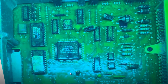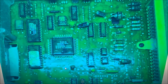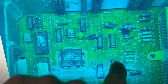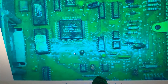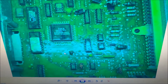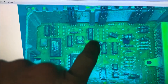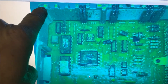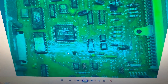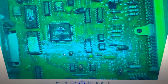The experiment I wanted to try was taking a picture of the board while it was under a UV light. Because oftentimes, like around the capacitors, you'll see the electrolyte glowing — it'd be kind of a white glow. You can kind of see around the edges here how it's glowing yellow under the UV light. But in this case, the caps aren't leaking because I don't see anything.